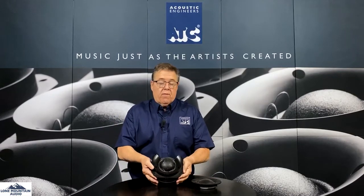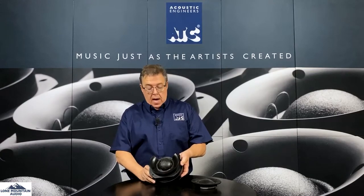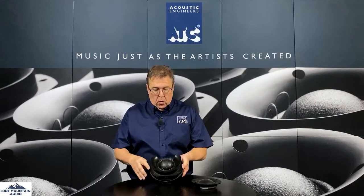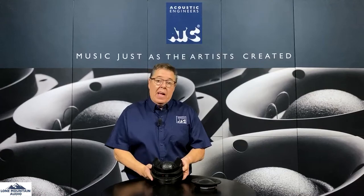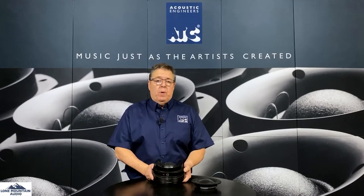This part is designed to work from 380 Hz to 3,500 Hz — very unique. Being a 3-inch dome, it will have much better dispersion than a cone because it's a dome. The goal is really to have it sound the same on this end of the couch as that end of the couch — to have it be the same over the widest possible area.